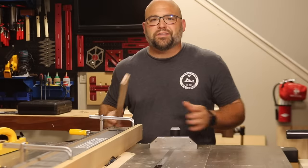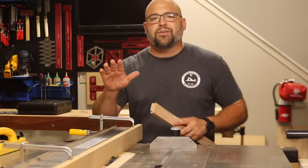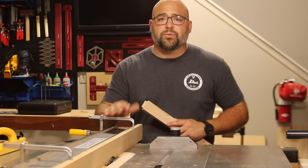Of course, if this was for a project I would have used different measurements for my tenon, but I wanted to show you with the current setup how you can easily make tenons with a dado stack and how useful a dado stack is in a workshop.